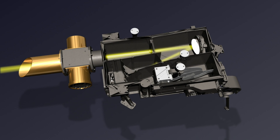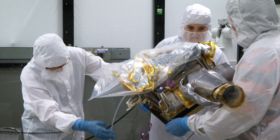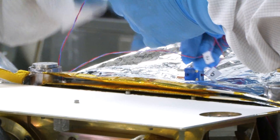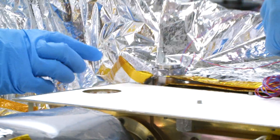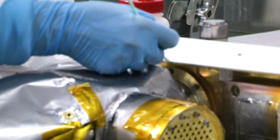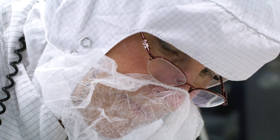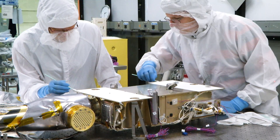OVIRS is a very simple instrument — it has two mirrors and no moving parts. Moving parts are one of the things we worry about breaking in space, and once it breaks, your instrument is lost. The instrument has to operate in a very harsh environment: there's no air in space, there's a high vacuum, things can heat up. If you can eliminate moving parts, that's just one more risk you don't have to worry about — whether that shutter is open or closed, or whether that motor is moving. We very specifically try to get rid of things that can fail, and fail in a bad way.